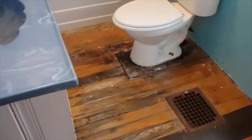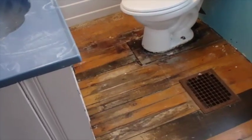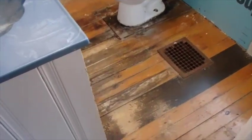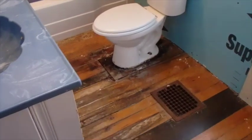I vacuumed up all the baking soda around the base of that thing. The baking soda was supposed to help absorb some of the smell. I think what's happening is that seal is leaking gas out of the septic tank, and y'all can all imagine just about what gas out of the septic tank smells like.